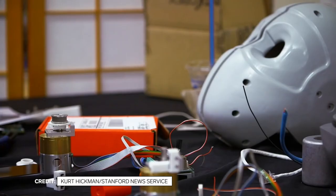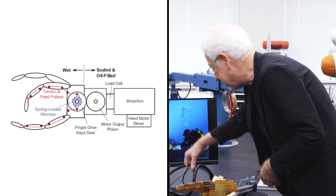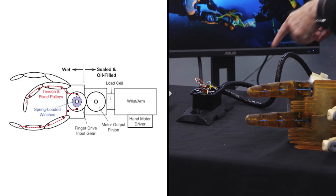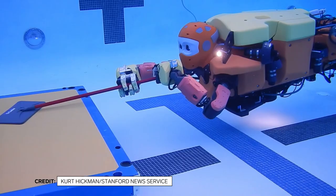The pressure underwater at great depths also meant sensitive electronics needed to be protected, so they developed this system. The arm is completely filled with oil, and this oil is under pressure coming from outside through a compensator. Inside the arms, you have the same pressure as outside the arms — and then you're safe. Oil-filled structures are very important and a big challenge.